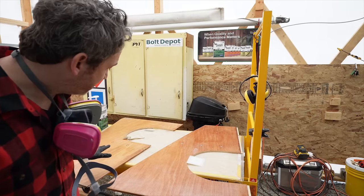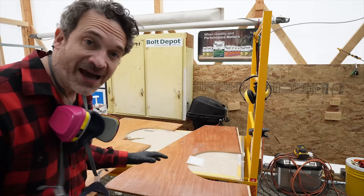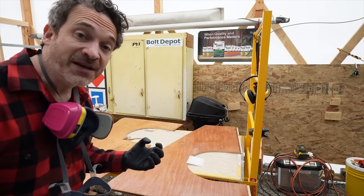It's pretty dramatic right now. You can really see on this piece how dry it is since it's been soaking in for a little longer than this one. So we're going to keep putting a little bit of wet epoxy on both pieces until we stop seeing that, and then we'll mix up some thick stuff and put these together.